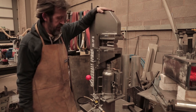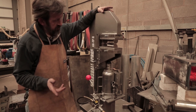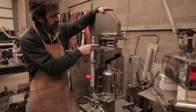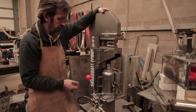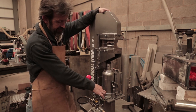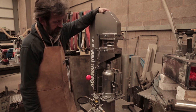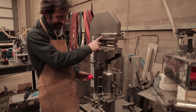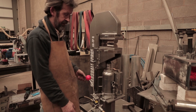So on the whole, I don't think that was too bad. There's a few little things I would change. One thing - the dies being cold, they're just going to suck the heat out of the metal. So probably preheat the dies when you're using it and keep them closed in between heats just to keep the heat in them. I did notice I've got a little bit of a leak from that cylinder - I think it was because I'd butchered it too many times and welded it, so I'll just find a replacement screw for that. This - the lever being here isn't so good because the hot scale falls under your hand.